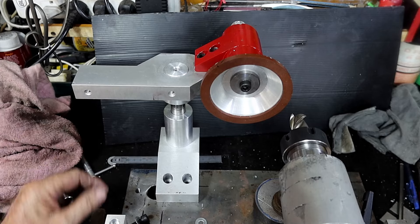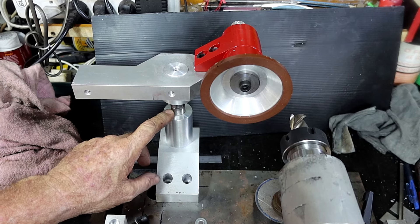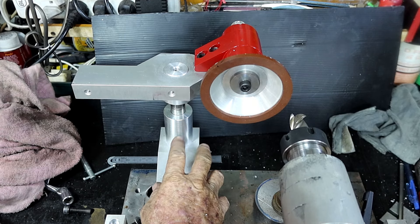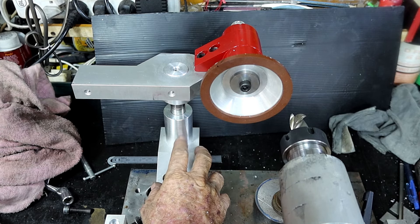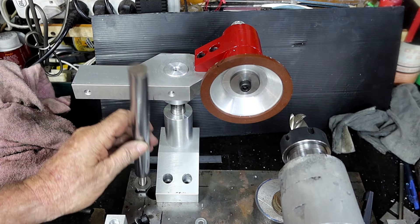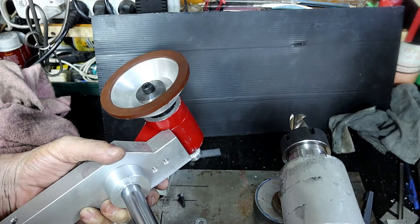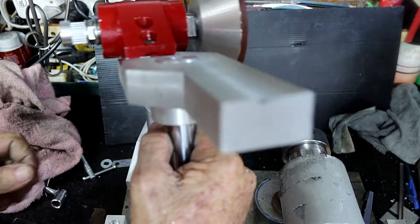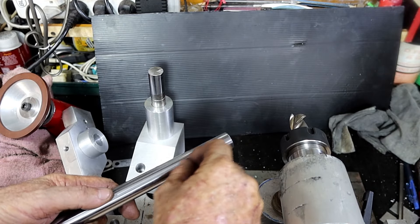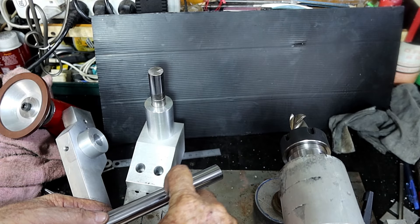I think I'm going to have to take some off the top of this - maybe 10 to 15 millimeters - because there's a 30 mil gap there. The difference in height between there and there is about 35 to 40 mil, so I might have to take 15 or even 20 mil off the top. The shaft in there is not the one I'm going to use - it's way too long, I've been using the shorter one just to make life simpler. Beautiful, good fit. What I've got to do once I get this to the right length is grind a flat through the chrome using the grinding wheel in the mill, then mill a 6 millimeter slot in it.